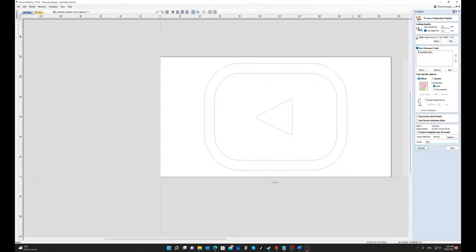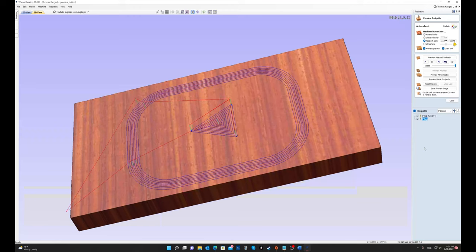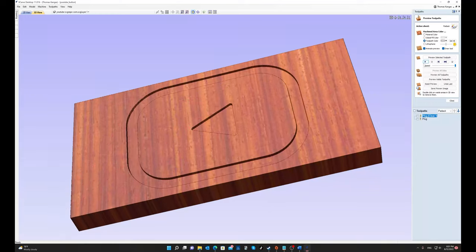If you plan to use a bandsaw to separate the material, I recommend about a 2 millimeter gap. I use my CNC to remove the bulk material, so I set it to about a 1 millimeter gap. For my plugs, I create 3 individual tool paths. This is because the start depth and the flat depth assume that the material has already been removed.